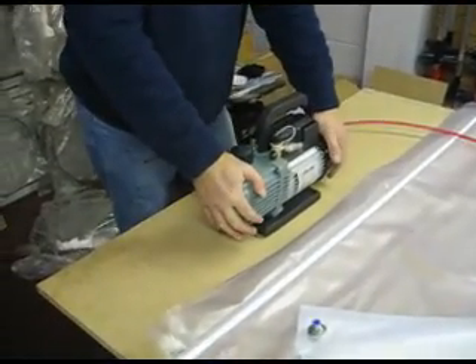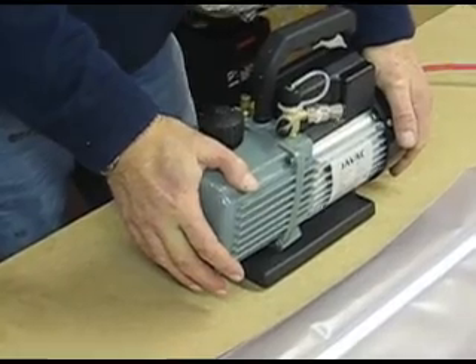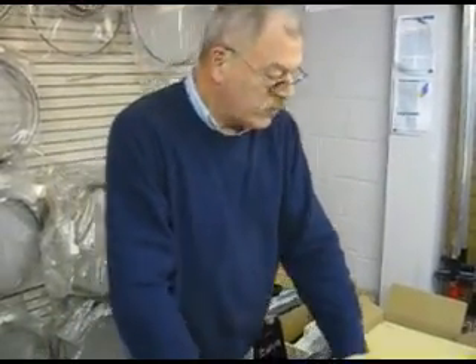In this particular instance we are using an electric motor to evacuate the bag. We use an oil-filled one because this gives you a better vacuum on the bag itself, even though the bag may have a small hole or not be very well sealed off.